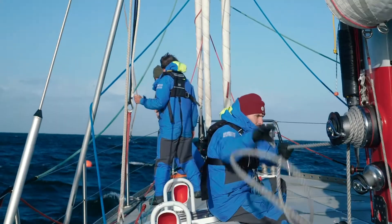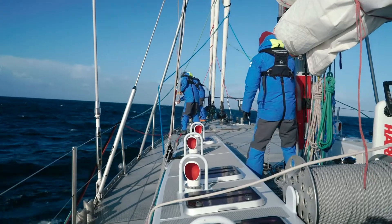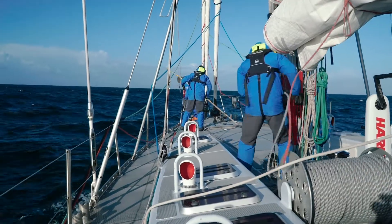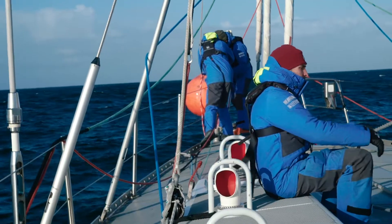For the recovery: imagine the storm has passed and you're in conditions like this, about 15 to 20 knots of wind with the sea going down. You need somebody on the wheel with the engine on, motoring toward the big orange buoy, going in between the little float and the orange buoy to snatch the floating polypropylene line with a boat hook. Because this boat is so big, we're going to clip a gennaker halyard onto a loop of line on the orange buoy and use one person on the coffee grinder to raise it quickly up to the top of the mast, snatching the whole lot up and out of the water onto the foredeck.